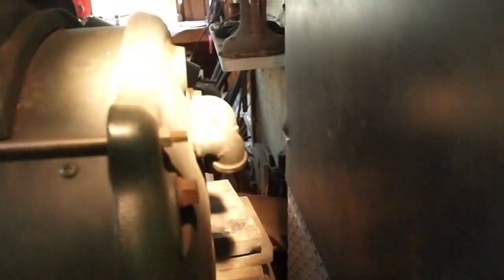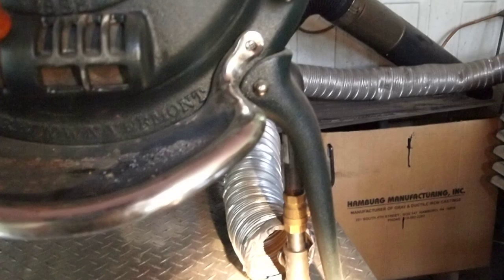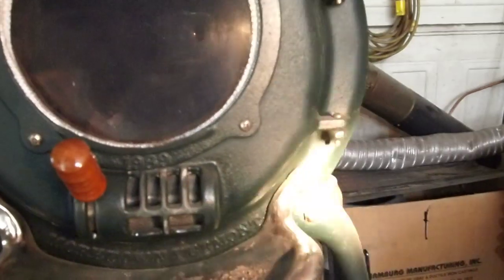The question was: do we also add controls for the secondary air? The customer and I agreed — and I don't know if you can see it — there are two elbows right in the middle that supply air to the box beam. We left those unrestricted. Basically, those are going to grab air from the room, but since the four-inch aluminum is open, air from there will go directly to the draft at the base of the door as well as around the back of the stove for the secondary.